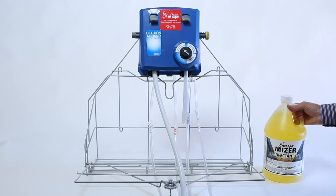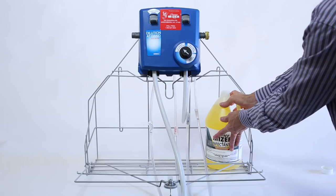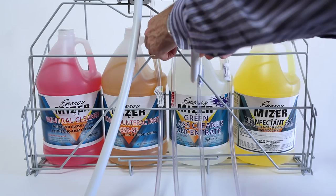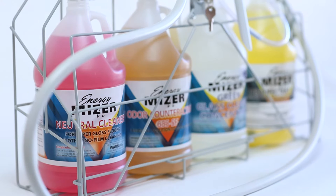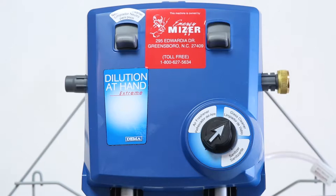Here's how to set it up. First, open and place all four cleaning solution bottles in the blending station shelf, and it's best to keep the solutions in the same order at all times. Then locate the feeder tube with the label that matches the cleaning solution and insert the tube all the way to the bottom of the correctly matched cleaning solution. Do the same with the remaining tubes, being careful to connect the correct type of cleaning solution with the correct feeding tube.